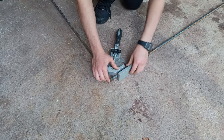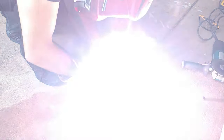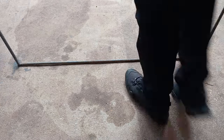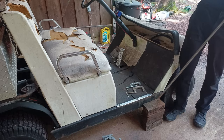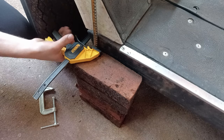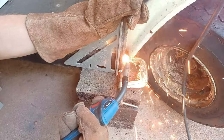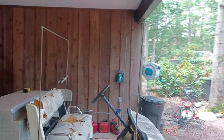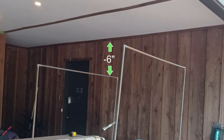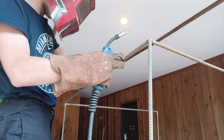It's time to clamp it down and start welding. Using a corner clamp will help me get a perfect 90-degree angle. Now that this part of the frame is complete, we can position it in place before welding it onto the frame. I just welded on a second U-frame, which is six inches lower to let the rain and debris roll down to the back of the roof. Next, we'll measure the distance between the rebar and weld on some more steel to finish the frame.